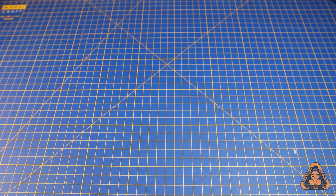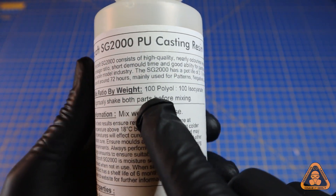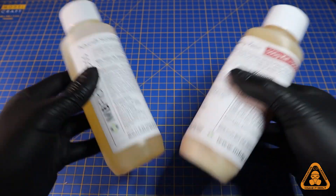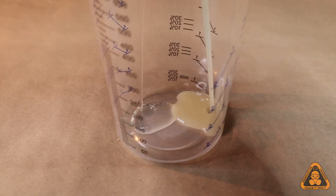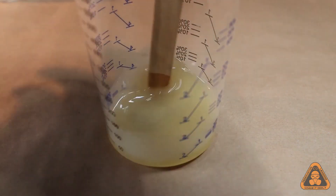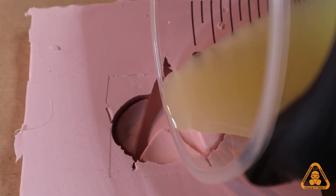There are many different materials we can cast from. The most common resin model and prop makers use is known as fast cast, though it goes by many names. It's an opaque resin that cures in minutes, easy to use as it's a 50/50 mix by weight — durable, light, and picks up every detail. First, shake the bottle before pouring into separate cups. Unlike silicone, there isn't much time because as soon as the chemicals are mixed curing happens rapidly — so much so that the cup will start to heat up. Tap the cup to knock out air bubbles, then carefully pour the resin into the mold.